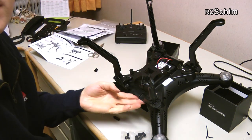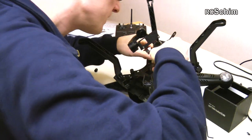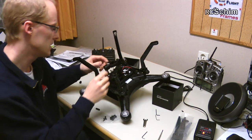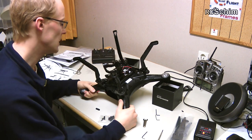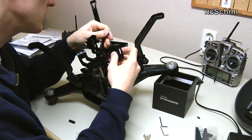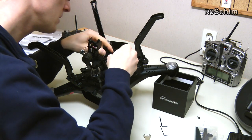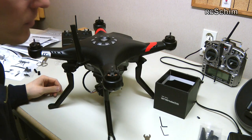The battery compartment is in the front and the cables are in the back. Feed the cables through the hole and attach the gimbal onto the rubber bobbin dampeners. Now I have the gimbal sitting there, vibration-isolated — or dampened. There's the GoPro connector. The last thing to connect is the gimbal control unit box — you can't do anything wrong here. Once connected, you have a nice cable run, and you'd use some double-sided tape to secure it. Really easy.